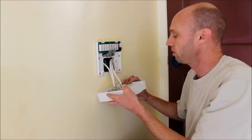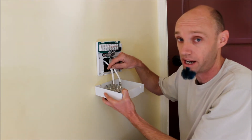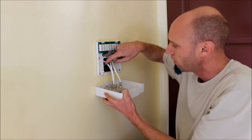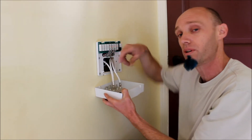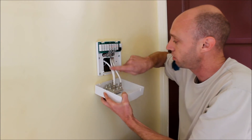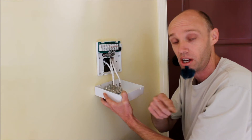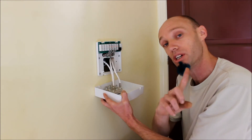You'll notice we have several pieces of wire coming in for the coax. This is RG6 coax wire because right now it's the best available. The first one is the home run — it's the one that runs at the front of the trailer. Next it comes into this splitter which splits it and branches it off to each connection throughout the house. We have one in the office, one in what could be the kitchen, and one upstairs in the loft.